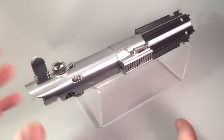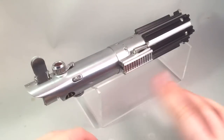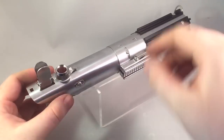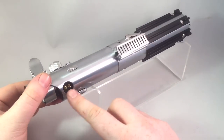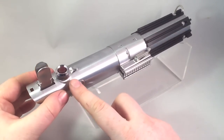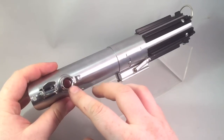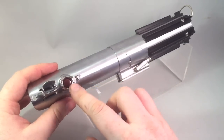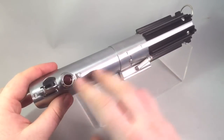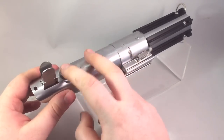This build is for Joshua. I do have quite a few different Graflex kits to build, and this is the one I wanted to get done first. Joshua doesn't actually live too far from where I'm based, so he came down and dropped some parts off. Some of the things I did for this install: there's an inner black sleeve which is the blade holder — I milled a slot all along it and a square hole inside for wire passages for the switch, and also milled a switch recess so it sits dead centre. Josh also had a replica Graflex button, because the ones supplied with the kits are red anodised, and he had the deep red plastic button, so I chucked it on the lathe and made that the button instead.